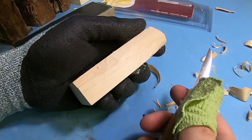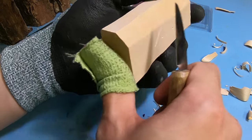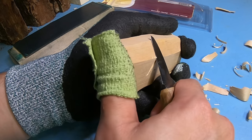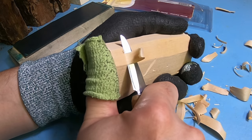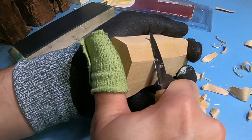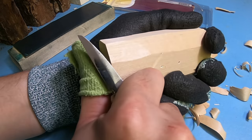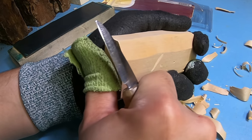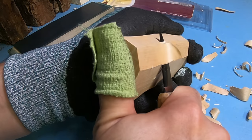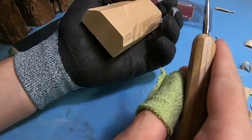Sometimes when you're doing a smaller carving it's going to be harder to do. Even with a paring cut, you want your thumb down here — not right where the blade is going to be coming and impacting your finger. Keep your thumb down and out of the way so that if you do accidentally overextend, you miss your thumb altogether. It's just safer and will help build good knife handling habits.